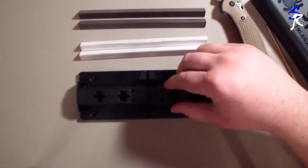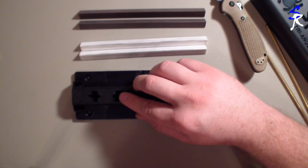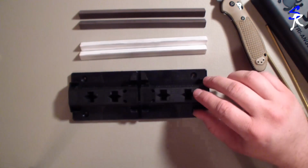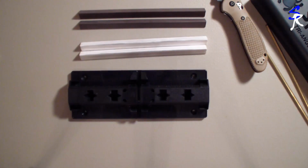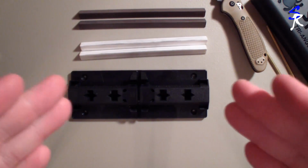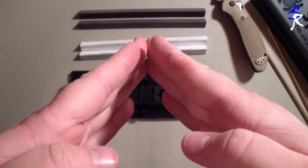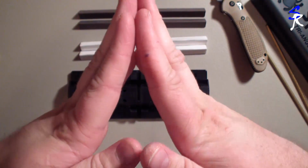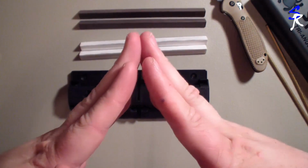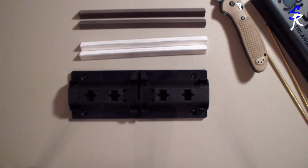On the Sharpmaker, you've got the 40 degree angle, which is what you're going to use most of the time, but every fourth or fifth sharpening, you're going to use the 30 degree back bevel side so that you can regrind that V and get it back to that narrow point, because as you keep grinding, that V starts to do this basically. Then you need to regrind it so that you get that point back. That's the best way I can explain it.